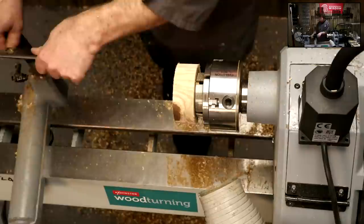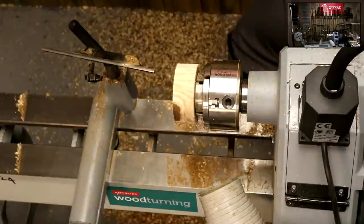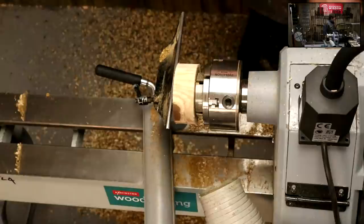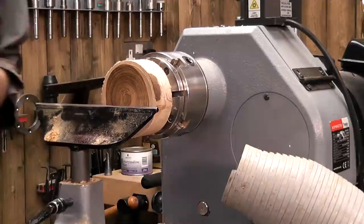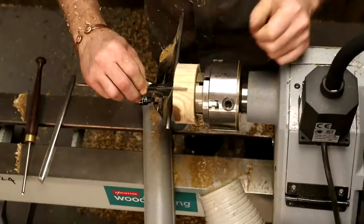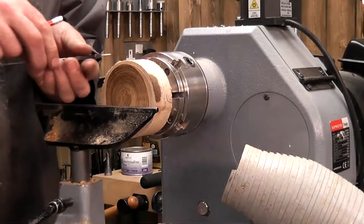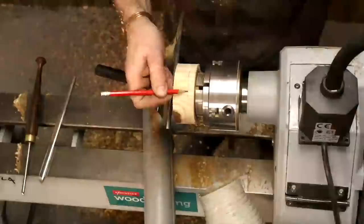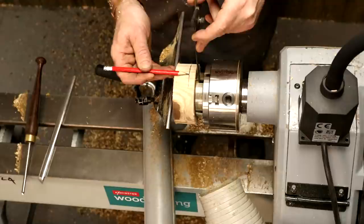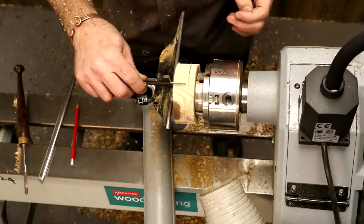Next, move the tailstock - it comes in the way. We're going to hollow out the inside. First thing: a depth gauge. I want to know how deep we can go. I've left a bit on here - I'm up to there. The material actually comes all the way up to where this ends on the depth gauge, so I've got a good three-quarters of an inch more if I need it. I've set the depth gauge. We're going to mark the center drill hole.